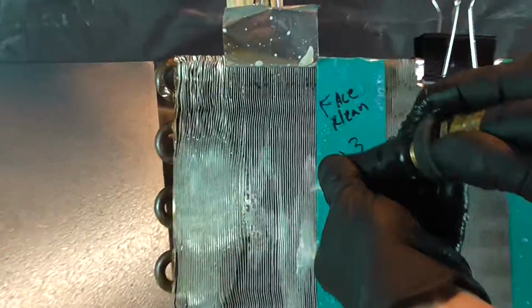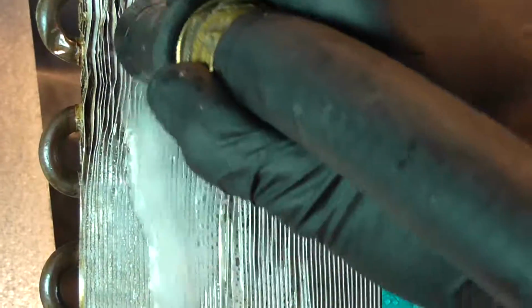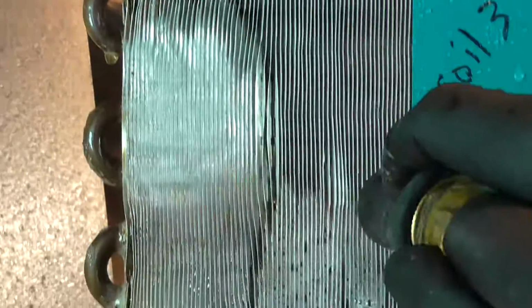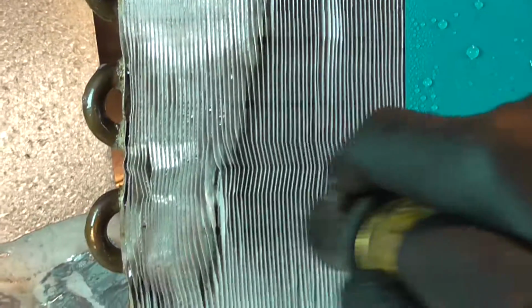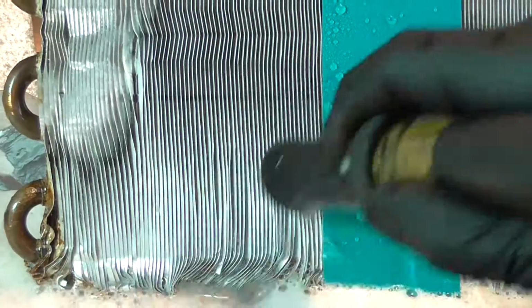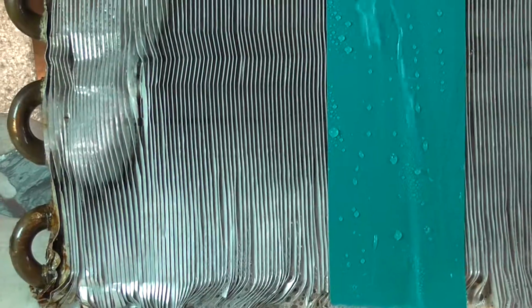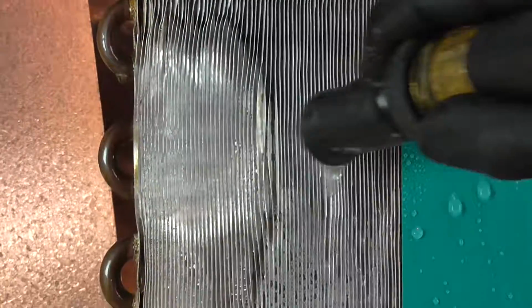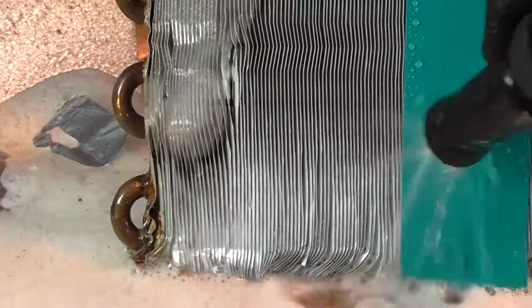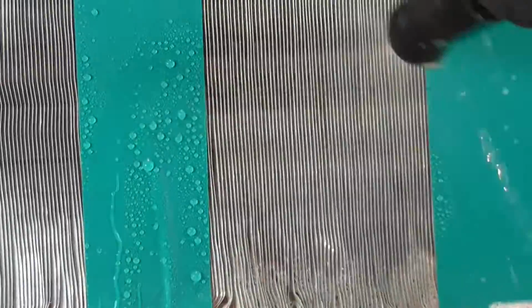As we try to explain to customers, there are chemicals that'll make the coil shiny, and everyone will think it's clean, but it's not clean. Just making it shiny. Of course, this coil is almost clear. Air is passing through this, no problem. If this was a plugged coil, which we'll show, there's no sense of testing the inferior products on a plugged coil. They just won't work. Once we get beyond this phase, we'll then take a heavily plugged coil and test that.